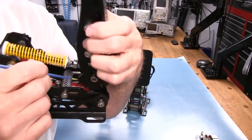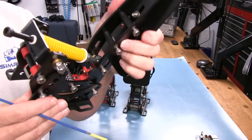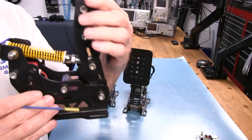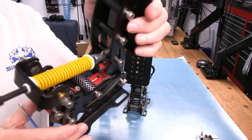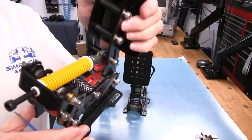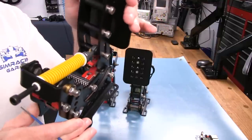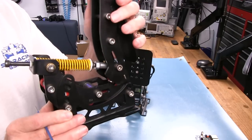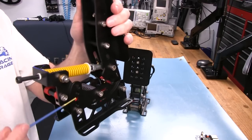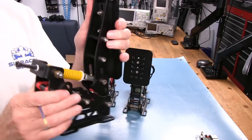And this is a 3D printed arm, also available in an STL file from the guys in India if you need it. Now, there's a magnet there, obviously, that plays on the Hall sensor down there. And the magnetic field increases as the magnet gets closer to it. And that translates into signaling that we transfer over to the PC and, of course, the game. And that's how we make things move. Now, the resolution on this has gone up, and that's in the electronics package. Now we're running 16-bit.